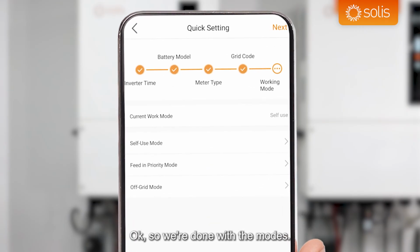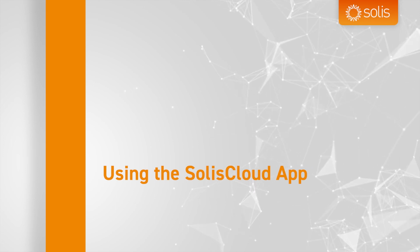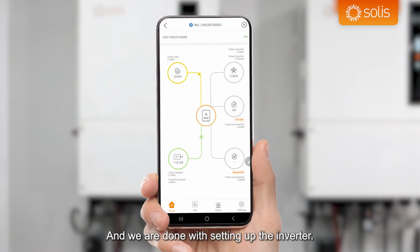Okay, so we're done with the modes. There are other modes on the screen. There is feed-in priority, which is seldom used, and I'll do a different video explaining that. And then off-grid mode just makes the inverter run in a completely off-grid mode, and it doesn't connect to the grid at all. Then you click next. And we are done with setting up the inverter.